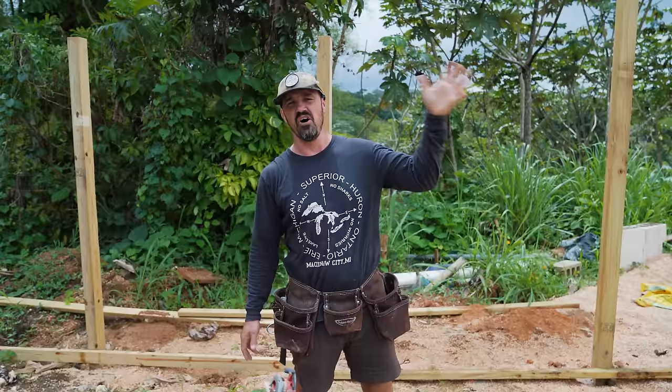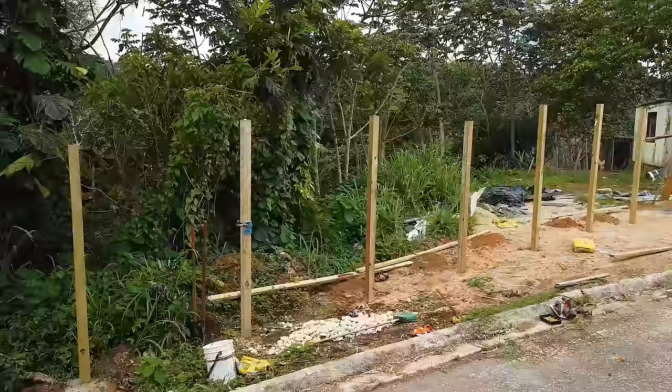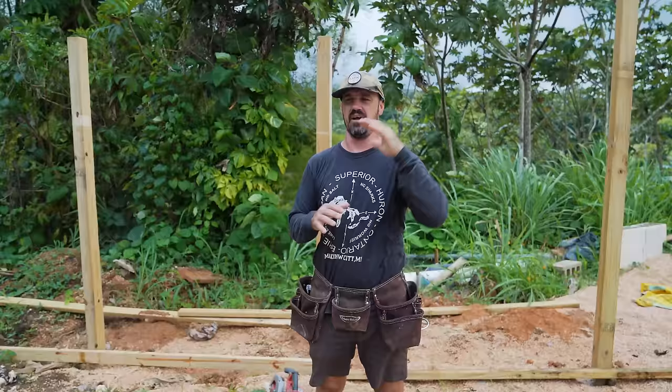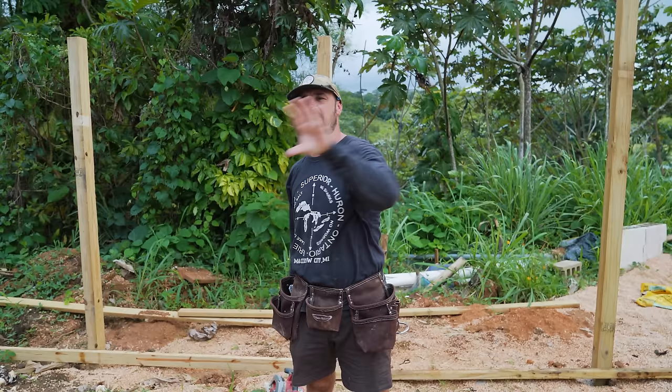The grade falls here. So what I'm doing to keep the structure and the load as evenly spread on the planks is I'm just following the grade. All the beams are gonna slant so that I'm getting a consistent hold for the plank, so that it's not a 4 foot gap over here and a 2 foot gap over here. It's gonna be one 3-foot gap all the way down, and you really will never see the back of that fence anyway. So I hope that's the right way to do it.